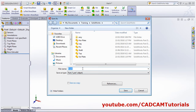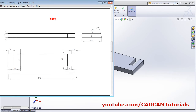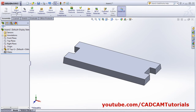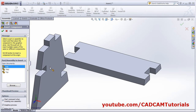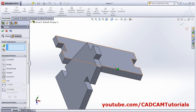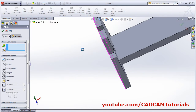Give the name 'step'. All three parts are ready. Click on new assembly. Open part documents are listed — first insert the top part, then insert the leg component. Apply mates: this surface matched with this surface, then this surface with this surface, and this surface with this surface.